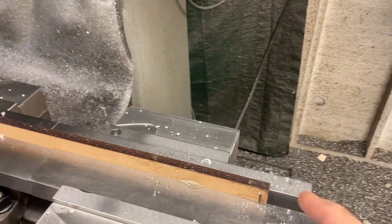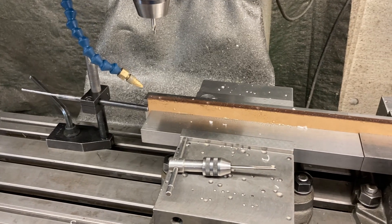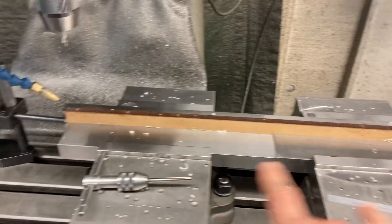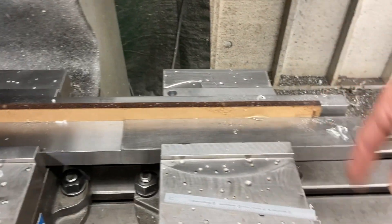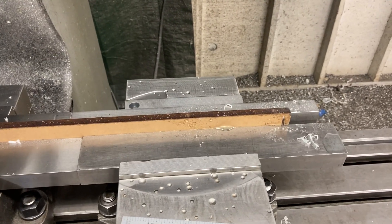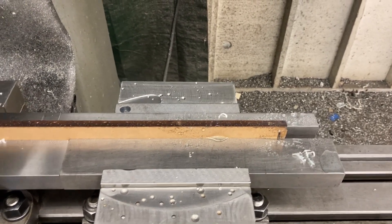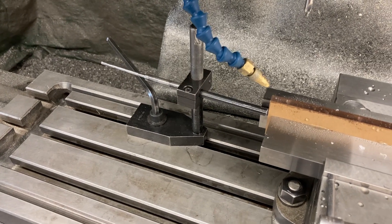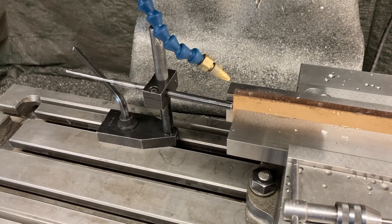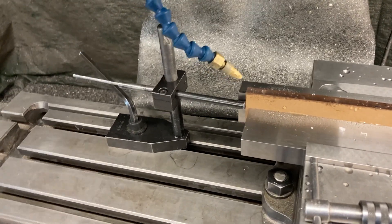One other point — the datum is on this end, the zero, and I'm stopping off the other end. You shouldn't really ever do that, but I machined these parts to length. I'm only doing two of them and I know they're both exactly the same length because I machined them both at the same time. I put them in the vise, machined one edge, zeroed the DRO, moved over half an inch for the cutter diameter, dialed out 22 inches and machined the other end — both at the same time. You can do this if you know the parts are all the exact same length.